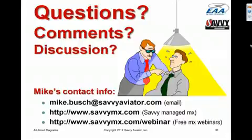Okay, here's another one. Why are mags still used on general aviation engines? 3 words: FAA. Basically, the reason mags are still used on general aviation engines is because to certify an electronic ignition system, the FAA certification obstacles are extremely high.